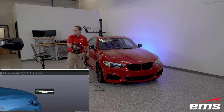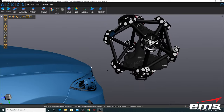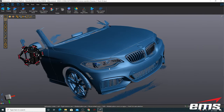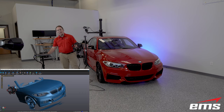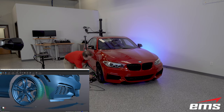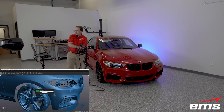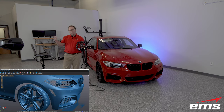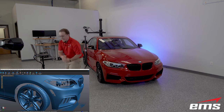To stop the scan, just hold the trigger to exit the scan session, and that shows an instant mesh within just a couple of seconds. This is very important — you can review the mesh, identify any areas still needed, go right back in to fill those areas, and then hold the trigger again to get the updated mesh back up in seconds. In prior generations of VX Elements, you'd have to wait up to several minutes to go from scanning to a viewable mesh, so this further speeds up the whole scan process.